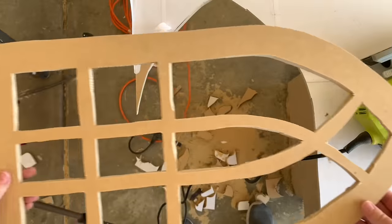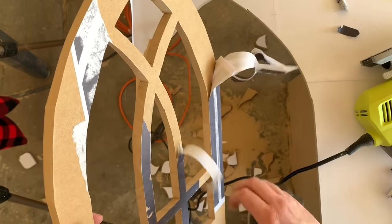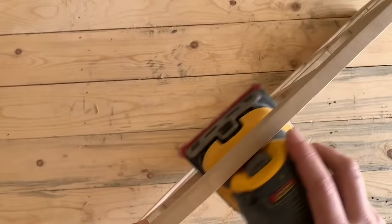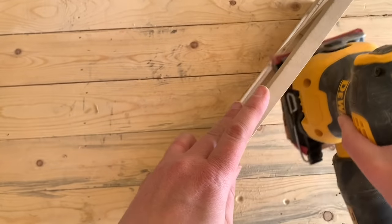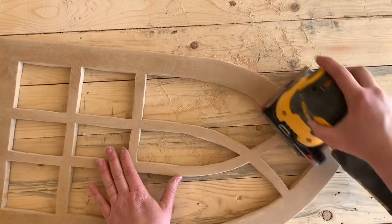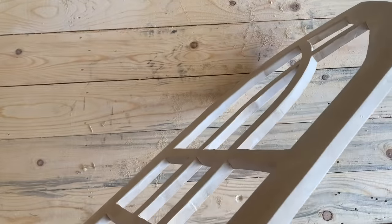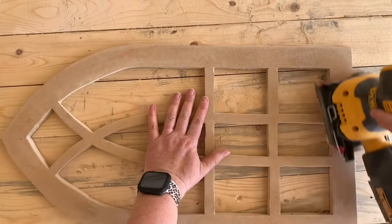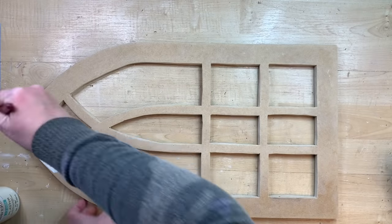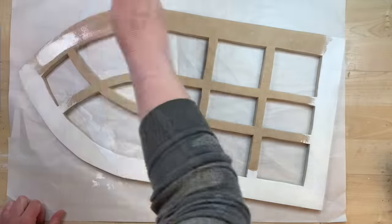When you have your jigsaw, it's got that trigger on it — when you're pushing it, it goes, and as soon as you let go, your jigsaw stops. So you have total control. Now I'm just peeling off this paper — if you need to use a wet sponge or sand it off you can. When you first cut it out you're like, this looks kind of ugly — the cuts are not super straight — but that's what you want. You want this window to look like it was carved out of wood. So you're just going to soften all of those cuts with a sander. I recommend using an electric sander — you could use a block sander but it would take a lot of time. I'm just going around all the edges, rounding them off a little bit. We want this window to look like it was carved out of wood and maybe has just sat around and been aged for a long time. I sand both sides and every little area that was cut with the jigsaw.